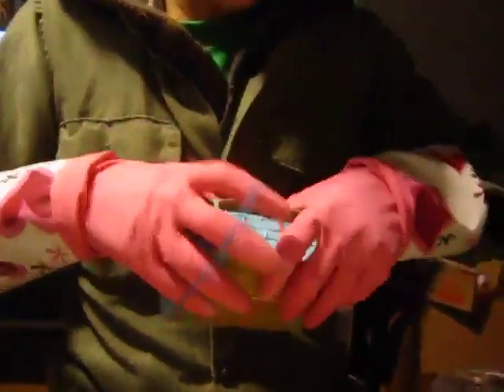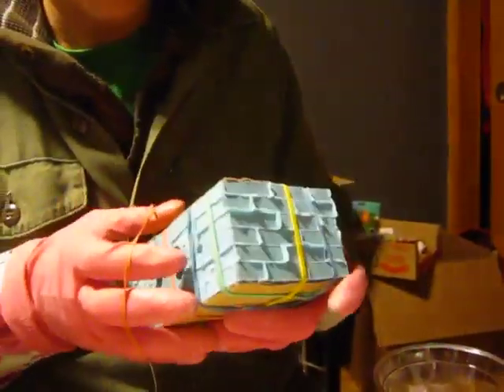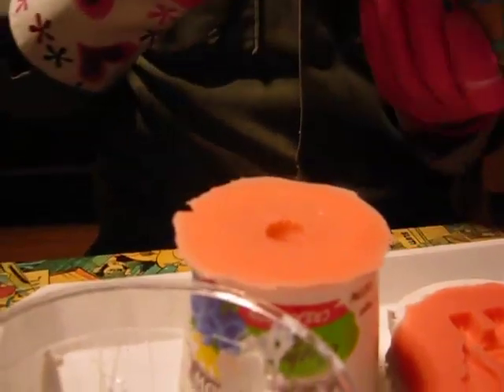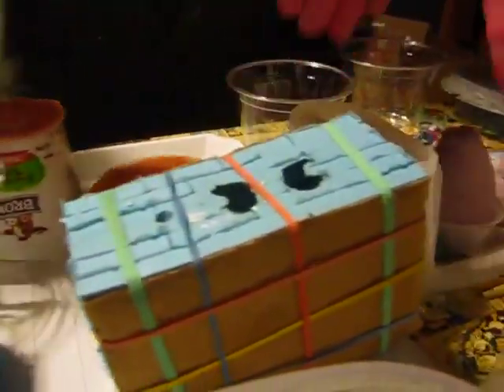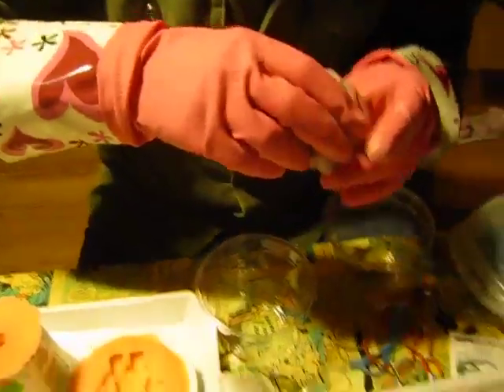You just want the edges to meet together to make your toy so it doesn't have a big seam down the middle. That's why two-part molds create a seam on your toys — you might have to clean up with an X-Acto knife afterwards. That's why I like glove molds — they can be seamless and you just sand the bottom of the toy. I also cast in a tray like this so if anything spills, it's easy to deal with and doesn't spill all over your world.